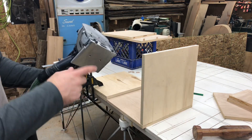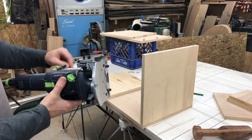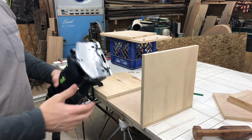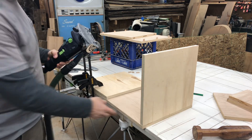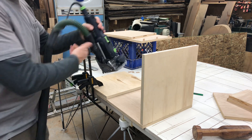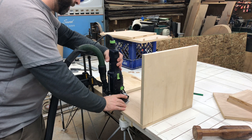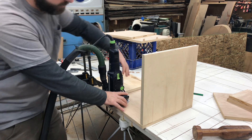Here's how I have my domino set. I have it set for the depth — I put it at 16mm, there's a little bit thinner plywood — but at 90 degrees, nothing special. We're going to go straight down, so it's going to register against the shelf and the fence side.